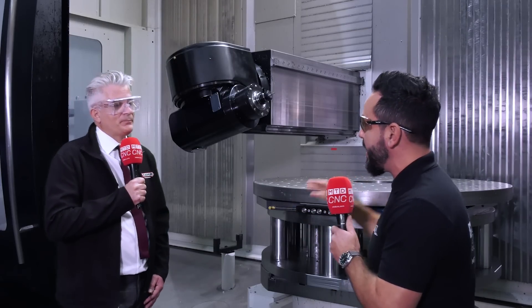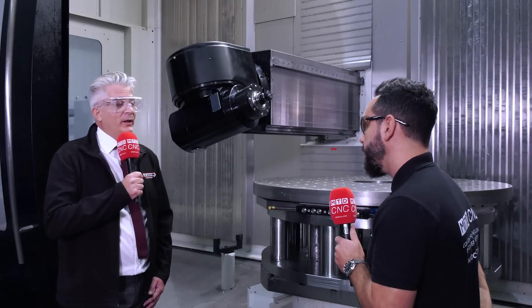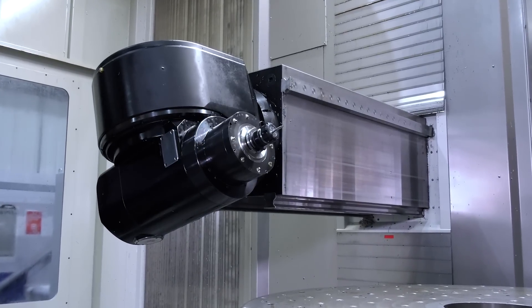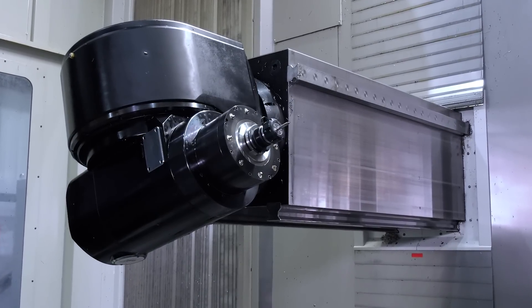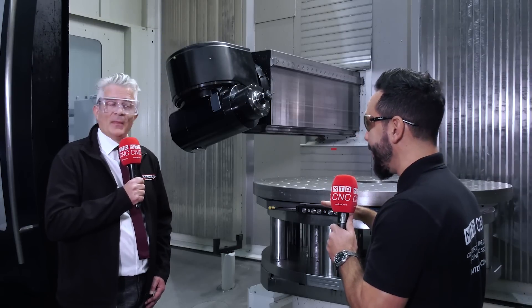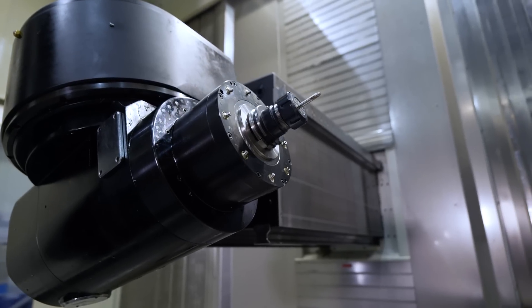With the 1.2-meter Y-axis and the ram design, do you experience any droop? By the nature of bed mill design people commonly call it that — though with the Shark we have a completely different ethos. Droop is always inherent in the design, and Grupo Parpus have developed their own droop compensation system. Through the main body of the Y-axis ram, there are four high-torsion bars moved mechanically to take out the droop over time. The machine is pre-programmed and adjustments are made to the droop compensation, so there is very little droop whatsoever.